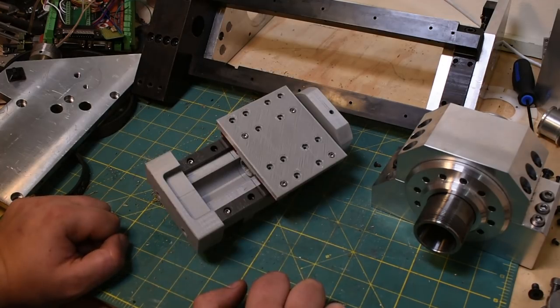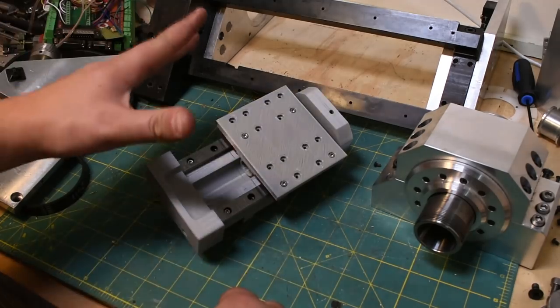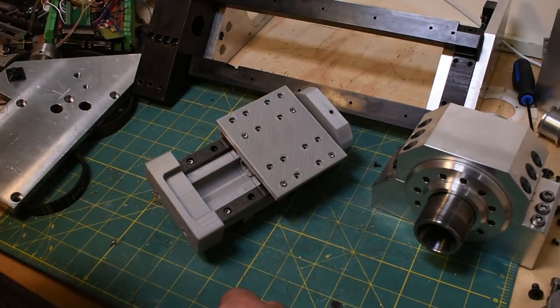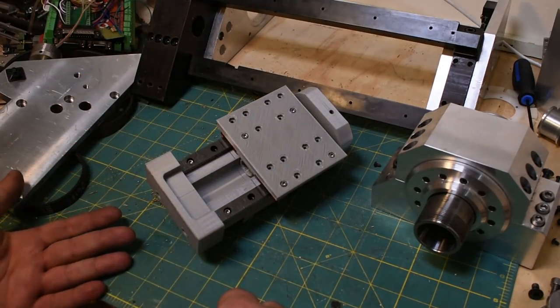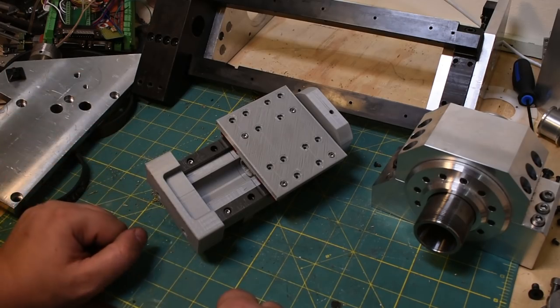One thing I also want to try is designing by functional group and then making a base around that. I'm a little ashamed to say I kind of started designing the base on this lathe before I knew what, say, the cross slide was going to look like. And that really limited me in cross-slide height, which is part of the reason I couldn't use a ball screw.